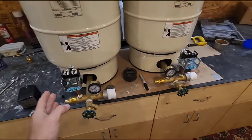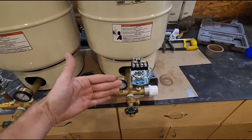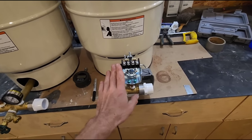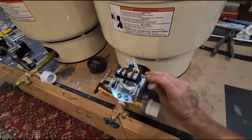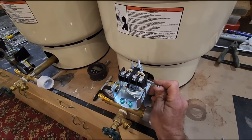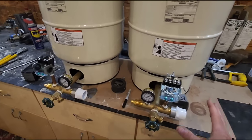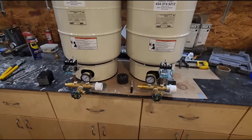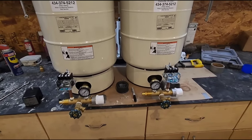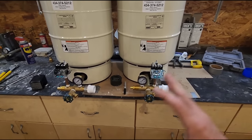Both switches work identically except that this one has the ability to trip itself off, just like a breaker would in a short circuit environment — it just does it mechanically. So now that you know how to reset your pressure switch, just go down, find your tank, hold the lever, give it about 20 to 30 seconds, and your system will be back to running. If it doesn't work, feel free to leave a comment and I can help diagnose your situation. Every well pump system can be different, but I'd say 85 percent are all going to be identical.